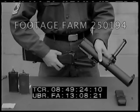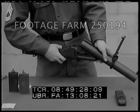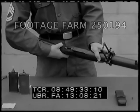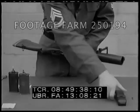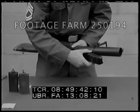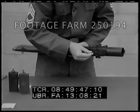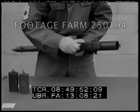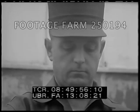Join the barrel group to the receiver group. And lastly, replace the forend assembly by engaging the recess of the forend on the cocking arm and sight base lug. Now secure the machine screw with the combination tool.